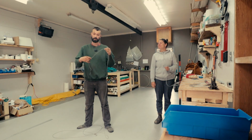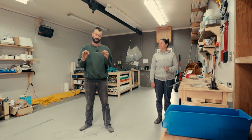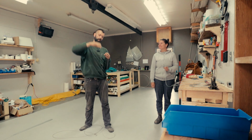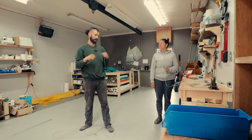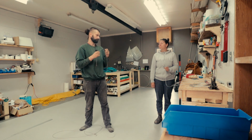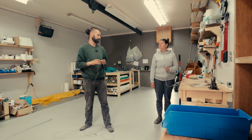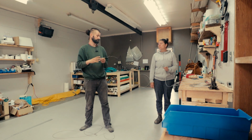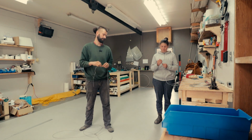We've got the old halyard here. Measured it out, this was 18 feet? 18 feet. But as you saw me dangling off of the mast, we were about 3 or 4 feet short. I would rather it a little short than too long, because if it's too long, I can't actually tighten the jib all the way, because it won't go through the mast, as we've learned. So I'm gonna go with 3 feet, and I'll just have to reach a little bit higher to clip in the jib. And now we just have to crimp up a new half of the jib halyard.